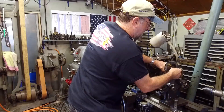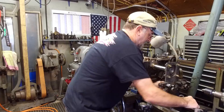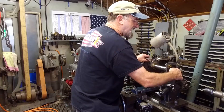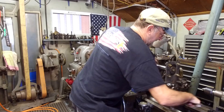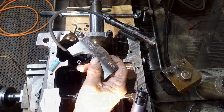What I wanted to show you is that after this bearing had rolled around - it's a self-centering flange bearing - and after it's self-lined itself, it is so stress free. That's what I was shooting for, and I wanted to show you that I actually obtained that. The alignment we've gone through - this bar is just like gliding and floating, and that's what we want. Let's tighten this back down and then we're going to start our first cut.